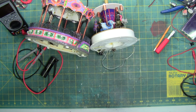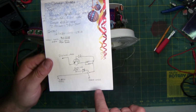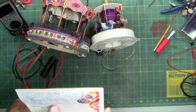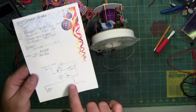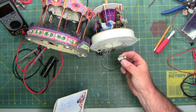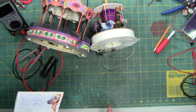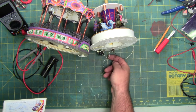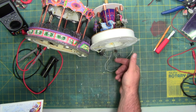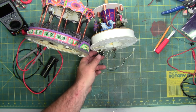Anyhow, the basic schematic for that circuit board down there is the standard diode, which is a 1N4004, another standard diode. That goes to the black wire on the motor, which is now over here because the wires came off. Everything's brittle because it got hot in here. One white wire goes to the motor, and the other white wire goes to the other circuit board. They are marked. I put a little Sharpie on them so I know which is which.